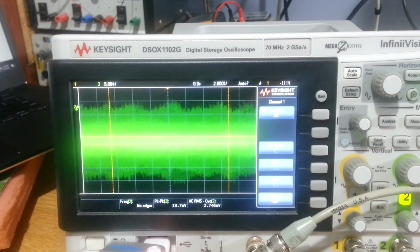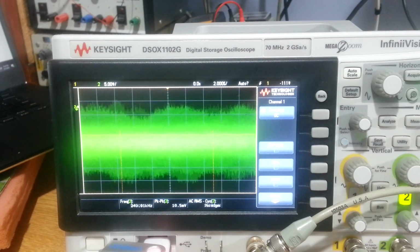That's at maximum there, and we're peaking sort of 15 millivolts peak to peak there. So you're going to hear a definite hiss through your loudspeakers when you're playing at high levels here, or when the level's set high. So that's obviously not very pleasant, and I think we can do a bit better than that. So we'll go and repeat that measurement on the audio analyzer, and we'll also look at the distortion.